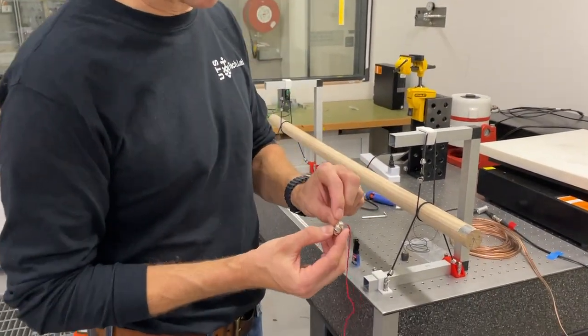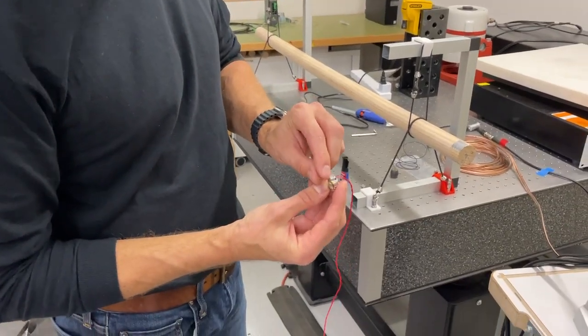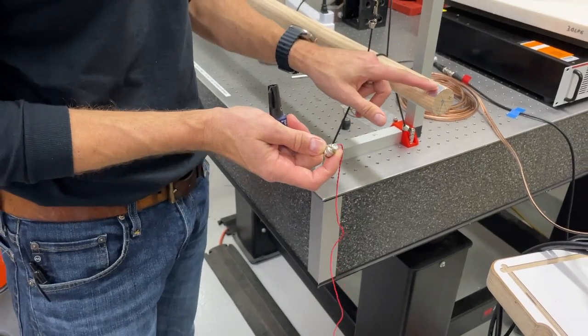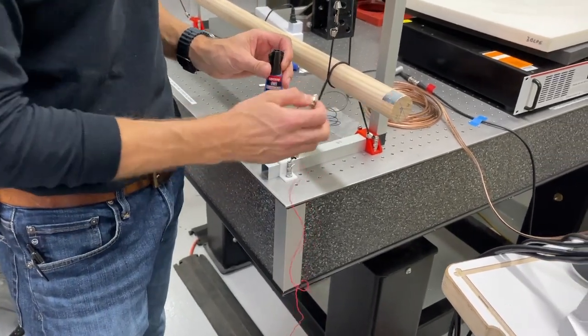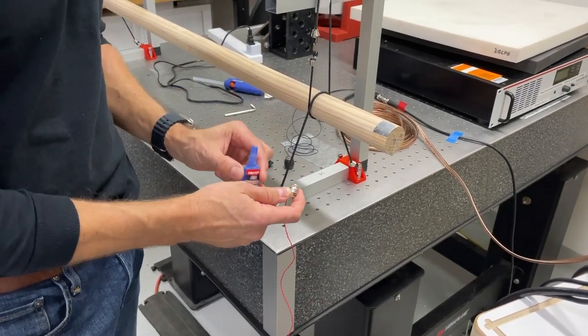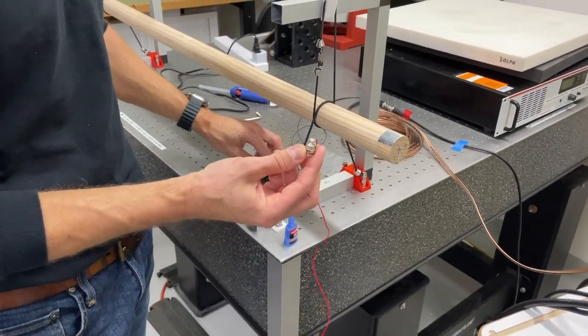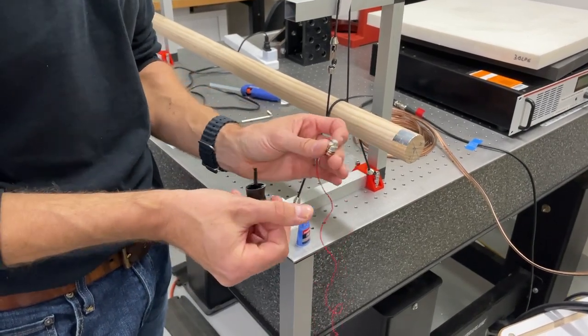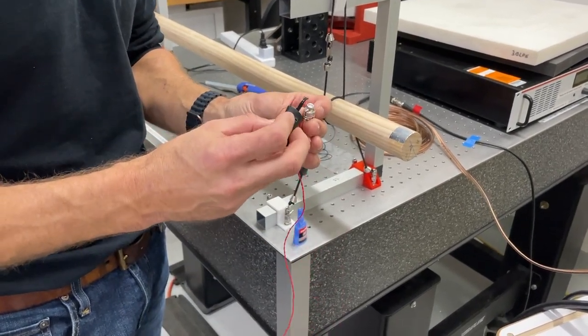So we've got a small flat, circular ring here, and we've put some metallic tape on the sample. For non-metallic samples, we need to be able to encourage some heat to be drawn out of the transducer. If we drive this shaker quite hard, it will generate some heat. So the metallic tape is there essentially as a heat sink.